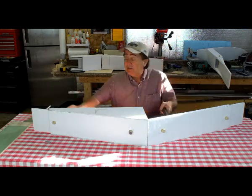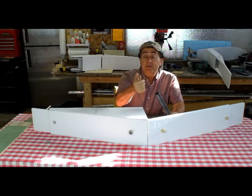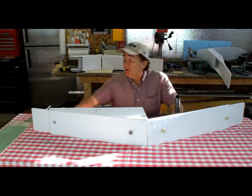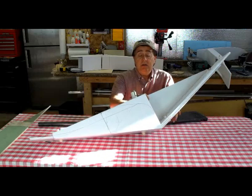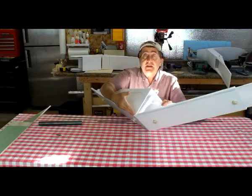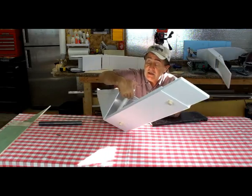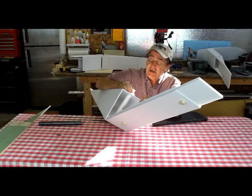The pin would only have a length just long enough to get through the various shear webs and hold the wing — one here and one out there. They'd be set up with a wood plug inside the tube and a little fiberglass tubing rod, so you'd have a pin about that long with a fiberglass handle so you could push it in from the back side. Then there'd be a securing system. I worked on multiple ways of securing the pins, and because there's a rear wall, the pins have to go in up front, with another shear web to take all the bending — it's a long way to get the pin in there.